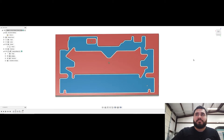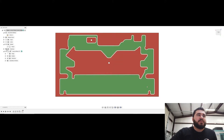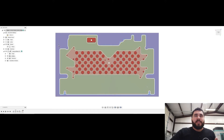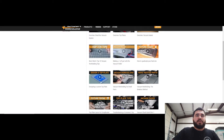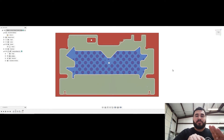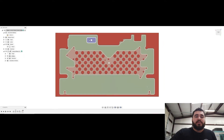The tip is to maximize the amount of vacuum area. What we try to do is look at the perimeter of the part and create a gasket channel just inset from that perimeter. I projected the silhouette of the part onto the plate, offset 50 thousandths in, and created my groove from there. The inner window area is red, meaning there's no vacuum applied there — that's where we're losing vacuum force. Because there are through holes there, if vacuum was applied and we cut through one, it would create a leak and the part would come off.